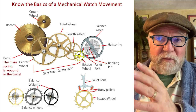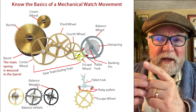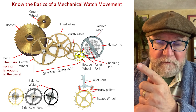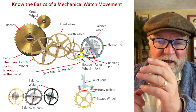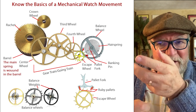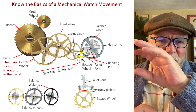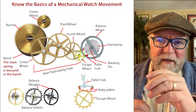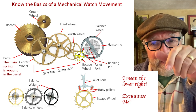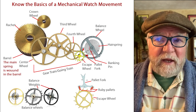What the escape wheel does — and what the whole escape mechanism does — is allow the tension from the spring to escape. This is done with the balance wheel swinging back and forth with the hair spring, which is winding and unwinding itself, getting kicked by the power coming up from the fork. It winds itself about a little over halfway — a semi-oscillation, about 260 degrees — kicking one way then the other. Each time it does that, looking in the lower left, the pallet fork unlocks one of the teeth, relieving the tension created back in the barrel by the main spring.